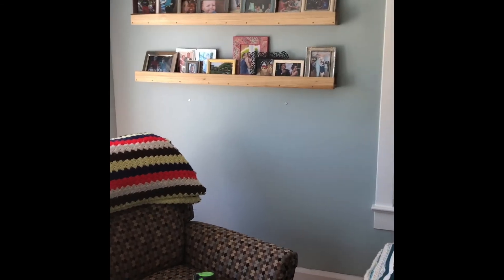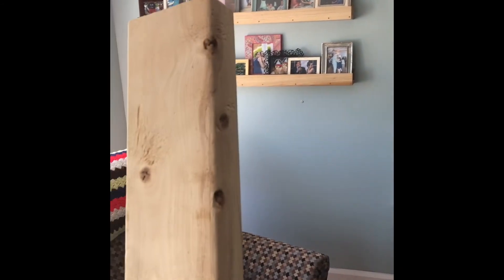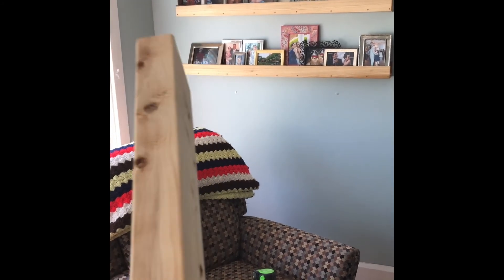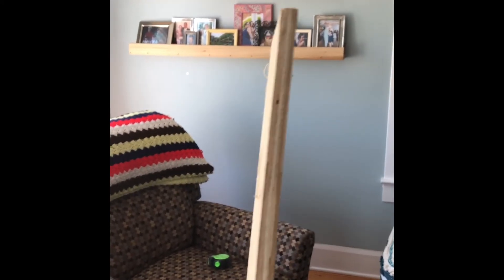The first thing you've got to find out is what you're hanging on to. The room we're in right now is basically a bunch of studs — two by fours that go vertically. And then in the ceiling, we have a bunch of joists, two by fours that run horizontally. So when we're hanging stuff, if we're able to shoot into studs, this is a big hunk of material, very secure for locking pictures or shelving onto. The rest of that material coating the two by fours is plaster, about a half inch thick — obviously not as good grip strength because it's made out of plaster, and not as much width for our screws to grab hold of.